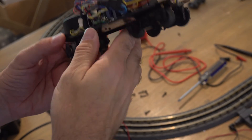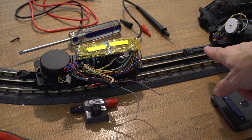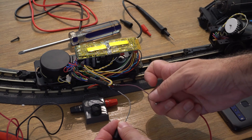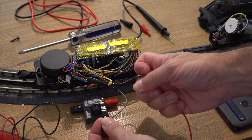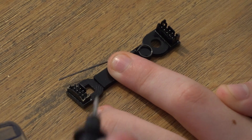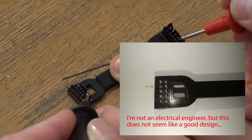Then we checked the coal car. What do we find in here? Over-engineered circuits. If you're wondering what that big round thing is, it's the speaker, and you'll discover it much later as it's very loud. In an attempt to isolate the problem, we just patched power directly into the coal car. We bypassed the railing and went directly to the back car — turn it on slightly, press the horn button, press the bell button. So we proved that power is getting into the locomotive from the tracks but not to the coal car. The culprit is the small connector between the engine and the coal car — just a little printed circuit board that gets flexed over and over every time you connect or disconnect the car and every time the train turns. It just worked the solder loose, so we put some globs of solder on that and that fixed the problem.